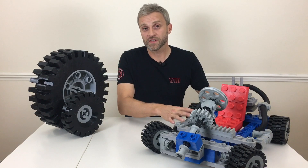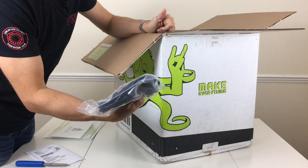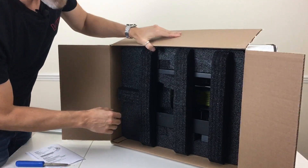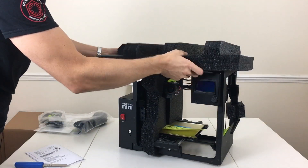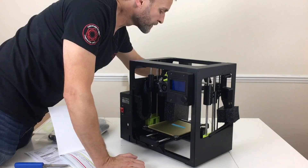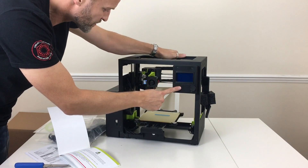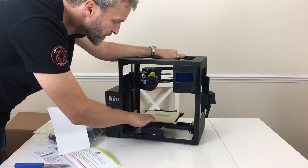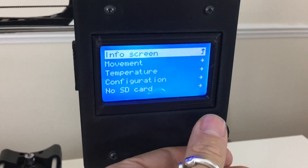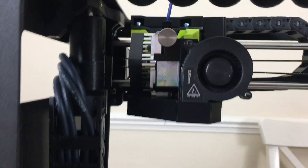The Mini 2 comes with the start-here guide, some filament, a USB cord, and a power cord — always beautifully packaged. There's the new head for the Mini 2, and also the addition of a screen — the original Mini never had this, it was always an option you could add on afterwards. It has the new reversible bed as well, with a belt-driven Z-axis. Taking a closer look: new screen, various options, and the new aerostruder with a squirrel cage fan and new cooling underneath.